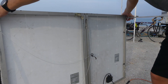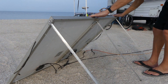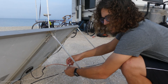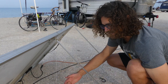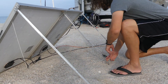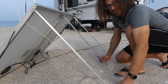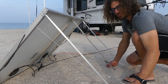I did that on both sides and it's just super easy to set this up wherever I want. Another optional thing I did was to run some nylon cord and I strap it up away while I'm not using it so it doesn't blow in front of the solar panel, because any little obstruction will just kill your intake. I've got these nylon cords so that I can stake these down. It's important that you have it at the top and at the bottom — this isn't going to work in crazy winds — but in gentle winds this is going to help keep your solar deploy from falling over.